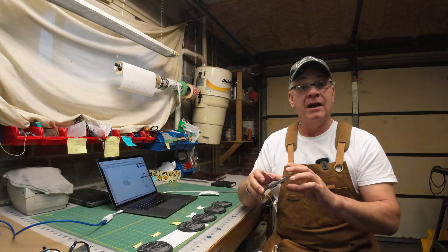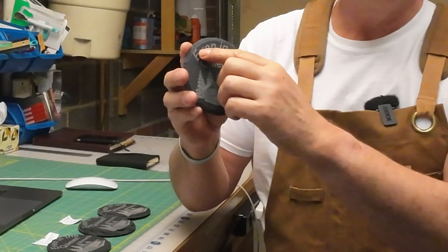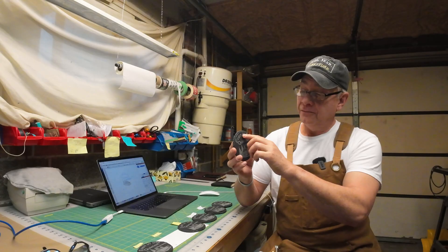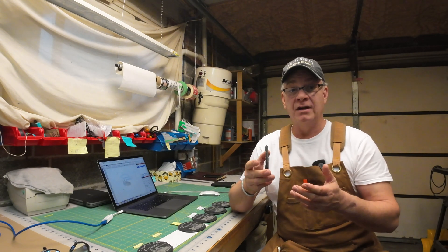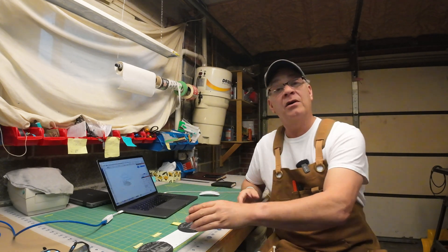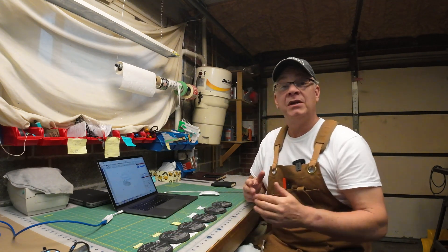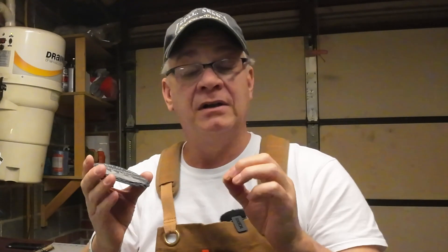Because in some cases I'd have a great outcome, except every once in a while on a letter it would be like it missed the engraving — very small inconsistencies. But if you do plan on selling product, you want a nice consistent engraving. So I just kept adjusting until I had the power, speed, and DPI right, so that the laser would ride over all of these undulations and still engrave consistently, and my letters would come out clean.